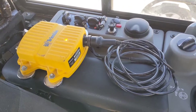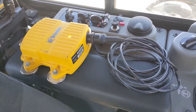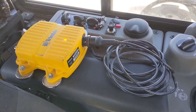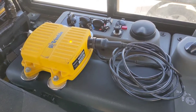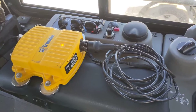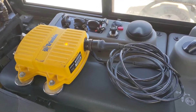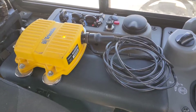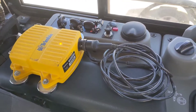Today I'm making a quick video on putting a Trimble SNR radio into a Komatsu iMachine — little D51 PXI here. I'll show the quick steps on how to do that, and I'll edit in at the end what it takes on the programming side through WinFlash. You need to open the serial port — all pretty easy stuff with readily available tools.